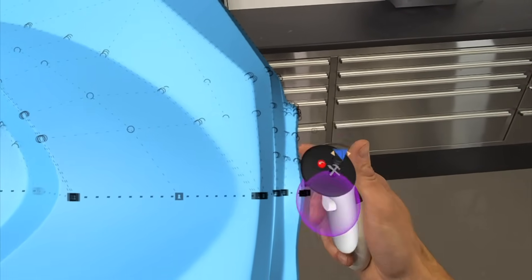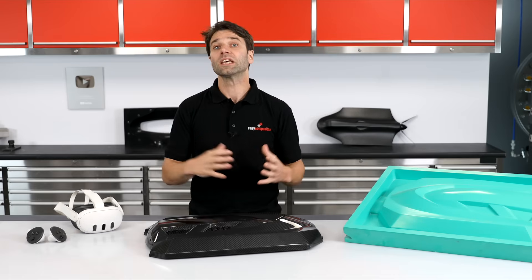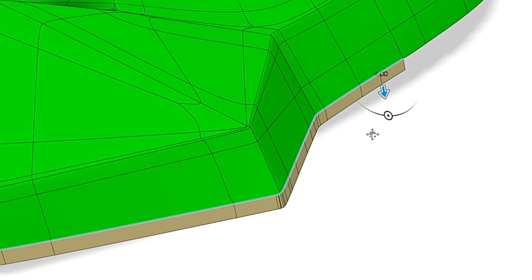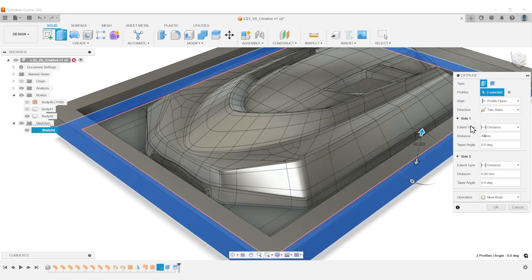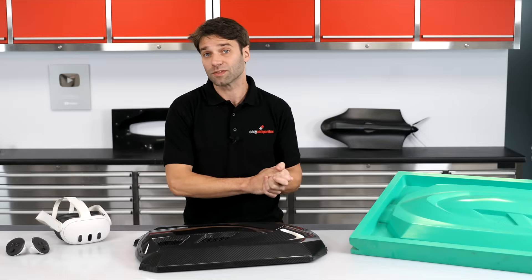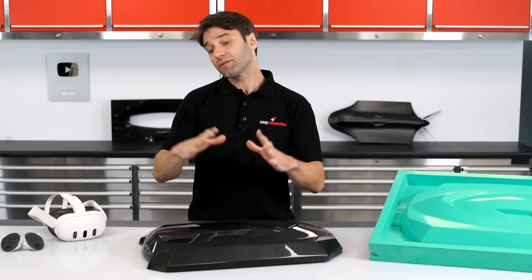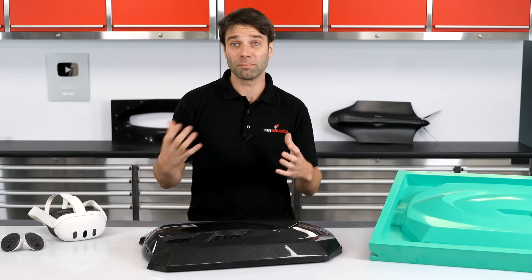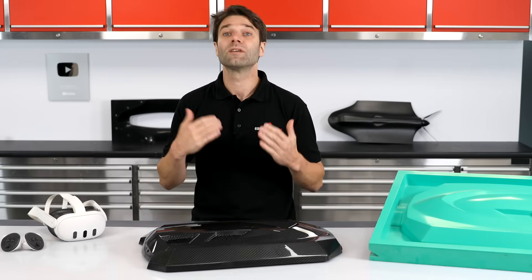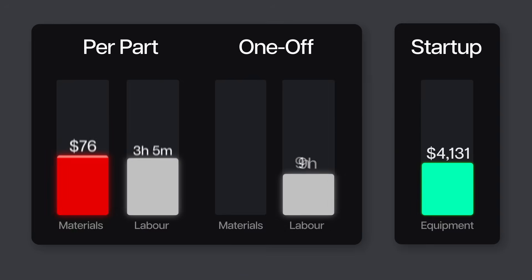I'm not sponsored, but I have been a fan of this for a few years. VR is definitely not the place for fine details and precise measurements, and so once the form has been produced, this surface model is then exported for use in a desktop CAD package. The VR generated surface model is then adjusted and refined in Fusion, and then extensions and returns are added to create the pattern geometry for trim and additional mould stiffness. Then toolpaths can be generated for machining on a CNC router. In terms of time spent on the design, it took 15 hours of hands-on design time between the VR and desktop CAD to get to this point.